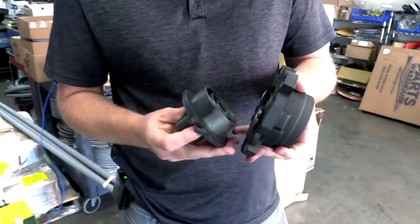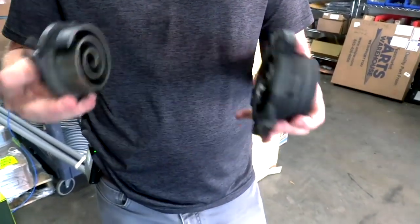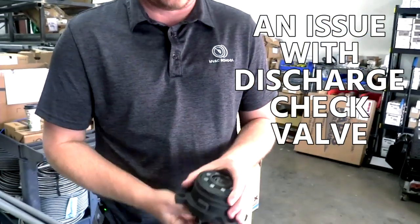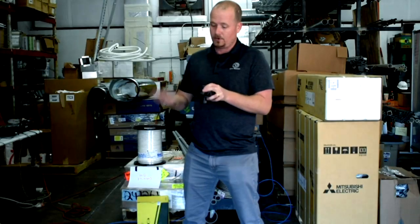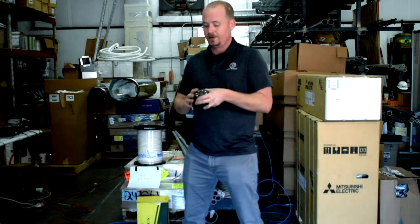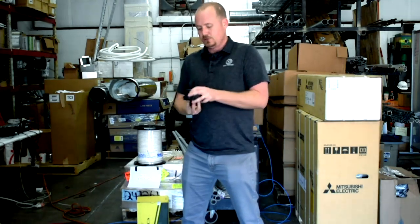If you have one of these that fail, you'll actually hear the compressor run backwards in the off cycle — you'll hear it make a sort of a sound. That's a sign that you have an issue with your discharge check valve. This matters for a couple of different reasons. Obviously you don't want it running backwards, because if it were to start running backwards and then you reinitialize power during that period, it might keep running backwards. You'll see that in some cases with short cycling.